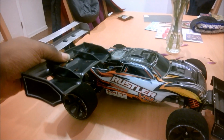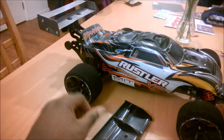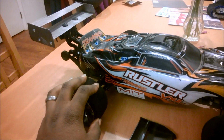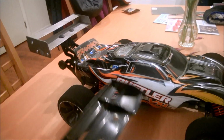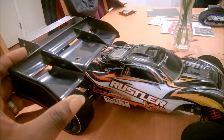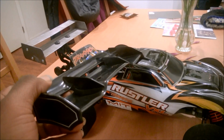So if you watch that video in slow motion, you can see the rear end of Slade porpoising, going up and down. Switching to the GTR shocks with their higher spring rate pretty much damped out or canceled out that fluttering motion. But it kind of masked the effect that this was producing a lot of excess downforce, which was basically just turning into drag. I mean, just look at it, it's not the cleanest aerodynamic shape.